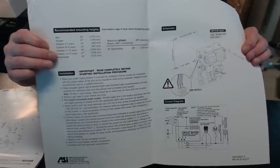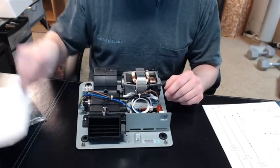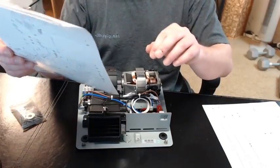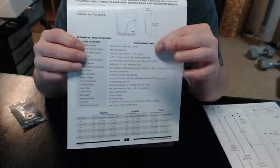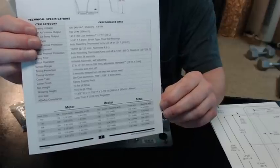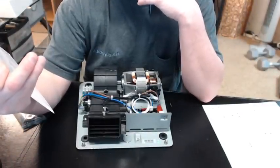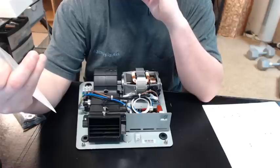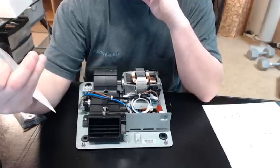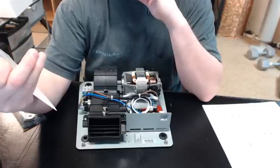You want to make sure you're mounting them at the right height and that the power is pulled at the right height too — I've had electricians pull power only to find out later they pulled it to the wrong location. There are technical specifications you can review in terms of how long it runs, what the delay is, and the drying time. Drying time is less than 28 seconds. It is an automatic no-touch unit with an infrared circuit, 1-minute auto shutoff, and a 2-second delay turn-off after the last sensor read.